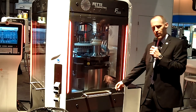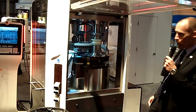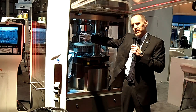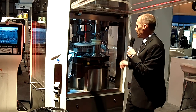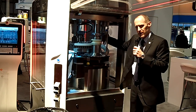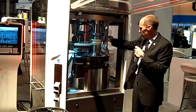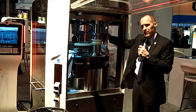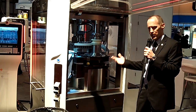The FE55 can be run in any of three modes. The first mode would make use of pre-compression and main compression for standard or classic monolayer compression, but it also gives the user the flexibility of adding a third set of compression rolls, as you see installed here. So in the second mode, you can use the press very effectively for difficult products or products that require more compression time.